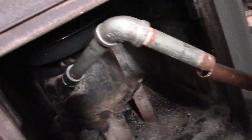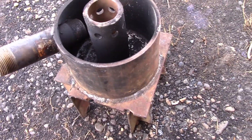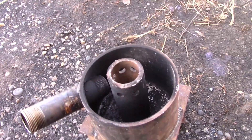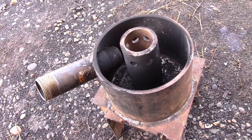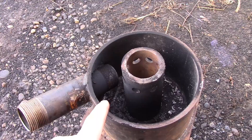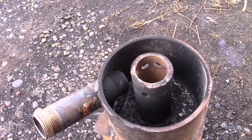So I bought some bigger pipe. Playing with my design a little more, I went from a small one to a larger one to get a bunch more air in it, but the burn quality went down when I went up. After studying the flame front, my conclusion is I'm not offering enough turbulence. I'm getting a good swirl but with the bigger pipe it's too smooth of a swirl. Testing again with the air compressor using a sharp nozzle that produces about as much air as the big one did at less pressure.